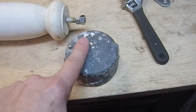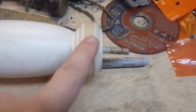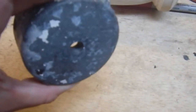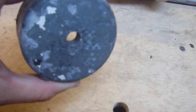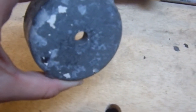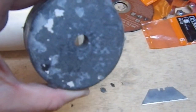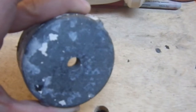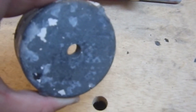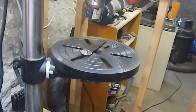First up is to find the middle and then drill a hole in this. I had to bring the diameter down a little bit, but that's fine. I was really shocked how thick this thing is — that's got to be a good quarter inch, maybe even more. That's a thick piece of metal; I didn't realize it because you can't really tell from the outside or inside. Now this is a nice snug fit at the moment, so when I bolt it in place later it's going to come in nice and tight. I think I need to find a washer though. Next up is going to be to put the V-block back in my drill press and get ready to start drilling the first of the four holes.